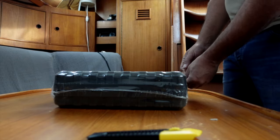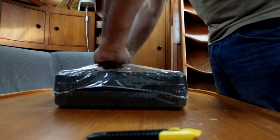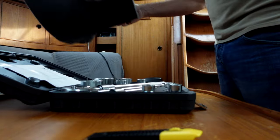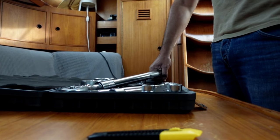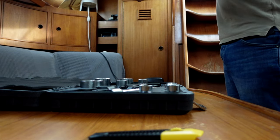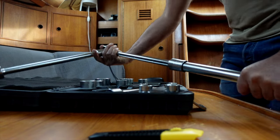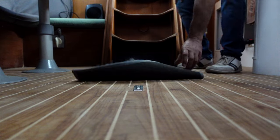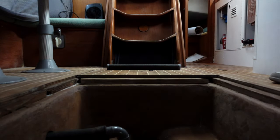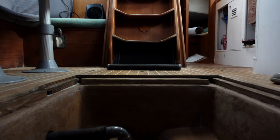Now that the hull is freed from its old paint, we stay under the boat, moving forward to prepare and remove the keel. The first step was to find an appropriate ratchet and sockets. We have 9 bolts holding the keel, tied up with 9 nuts. The first one has a diameter of 36 millimeters, so that one was okay. But the 8 others have a 50 millimeter diameter, and for such big nuts, we had to shop in the truck section.